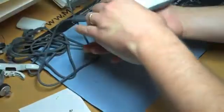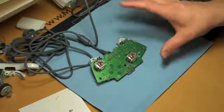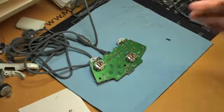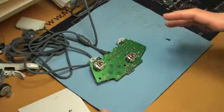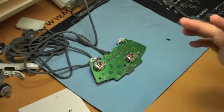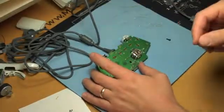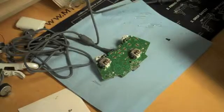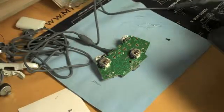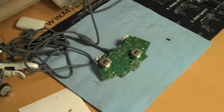On this one — I've shown it before — you disassemble your controller as we've shown before. I'll pop the circuit board out and set this aside. We're going to be working on a wired controller because it's missing the little charge dock and it's easier to work with. I've been attempting to film this for a few weeks — it's really hard with all the lighting — but I'll do my best to keep it in focus. Here's what the board looks like disassembled, and you can see those LEDs on there. We are going to change them out.